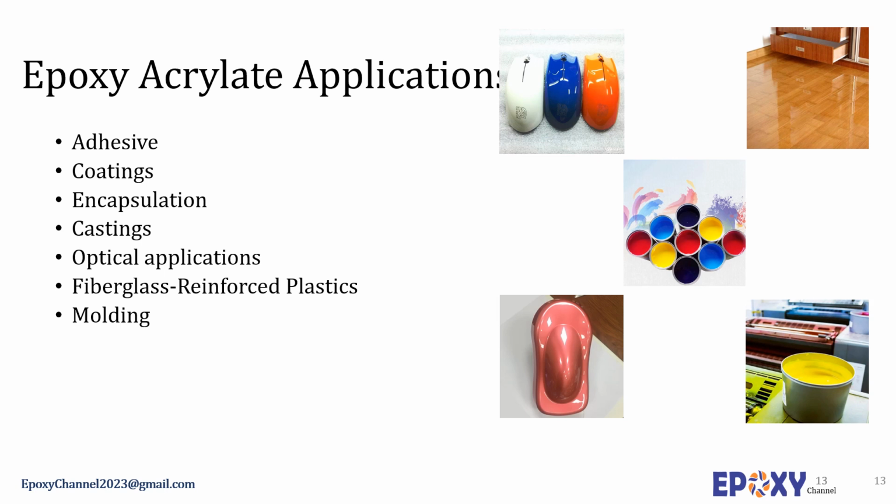Vinyl ester resin-based composites have demonstrated economy and better price to performance characteristics than steel and its alloys in many corrosive industrial environments. Vinyl ester resins can also be formulated into chemical resistant linings, grouts, flooring compounds, and mortars which can be applied by spraying. Vinyl ester resin based bulk molding compounds, BMC, or sheet molding compounds, SMC, are used in compression molded pipe fittings, housings, pump impellers, and automotive components. These compounds typically contain approximately equal proportions by weight of resins, chopped fiberglass, and fillers. Latent catalysts, pigments, mold release agents, and thickening agents are also added to these formulations.